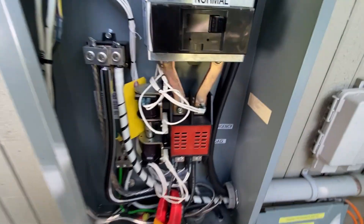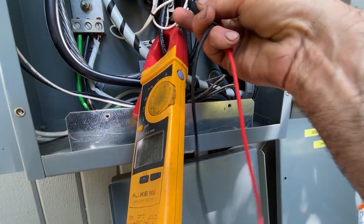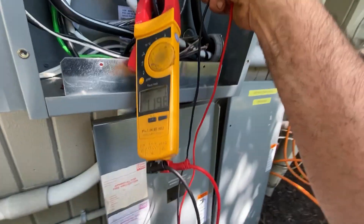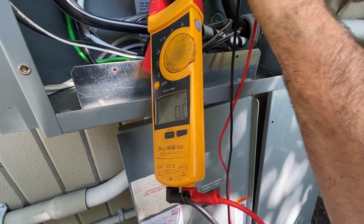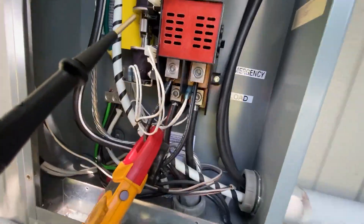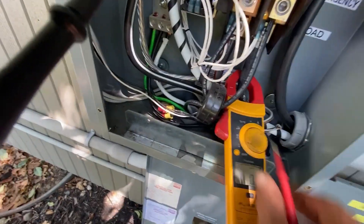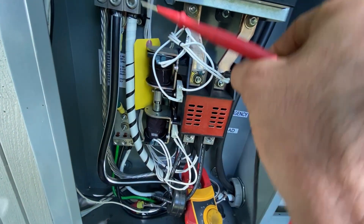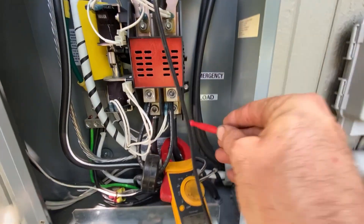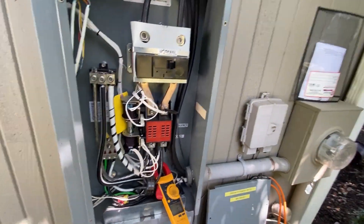Here's a first for me — I've seen it on many air conditioning contactors, but over here I've only got one leg of power. The generator is off but I only have half power to the house. I checked everywhere else and got 120V here. Working one-handed, I attach an alligator clip to hold my probe, come in the back, and I'm reading 124V — so my contactor circuit is open.